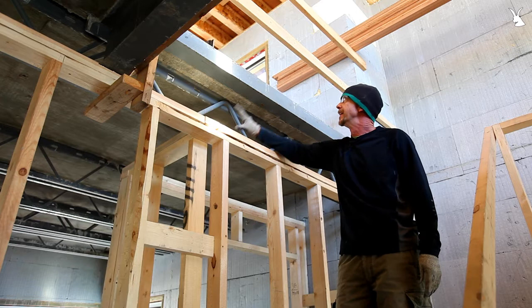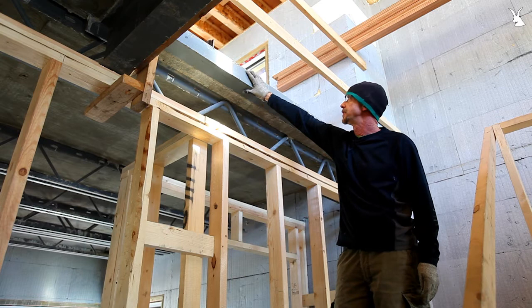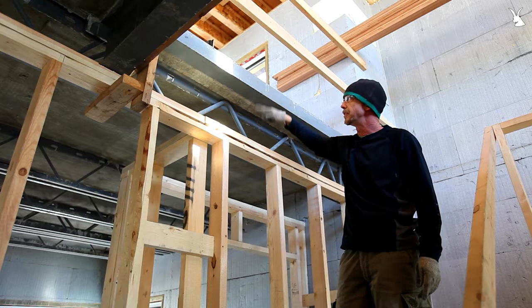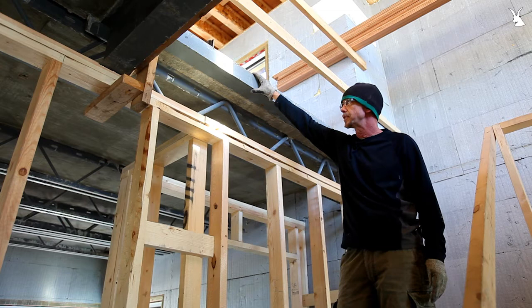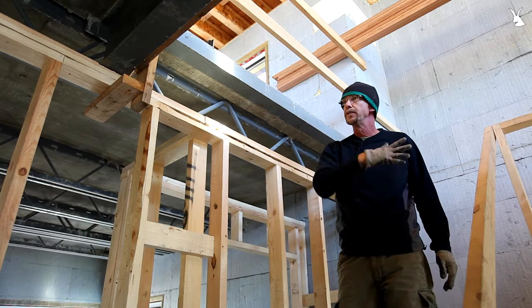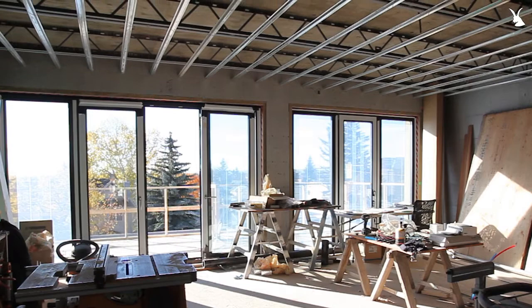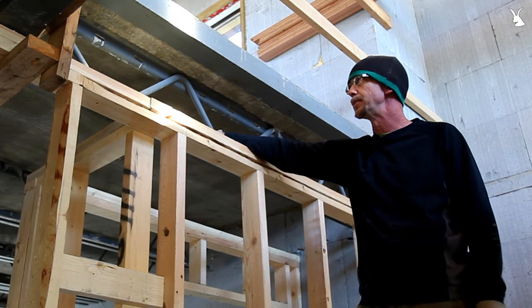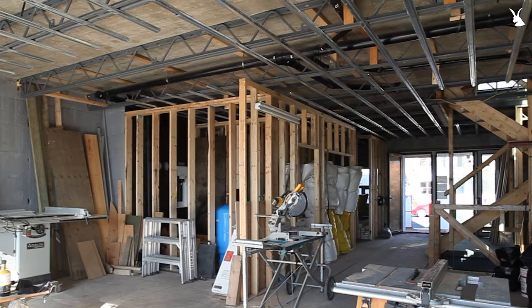This is a chunk of structural steel, but underneath it — for this thickness — it's concrete. So we have a high-mass floor with hydronic heating, meaning the heating cycles are not up and down; you keep a constant temperature and have thermal inertia from the high mass, making it much easier to control temperatures. Because of the strength of these joists, we can take out every interior wall as there are no load-bearing walls. So it offers flexibility for the next owner — they can redesign it any which way they want. It's quiet, it's strong, it's not cheap, but it offers a huge amount of benefit.